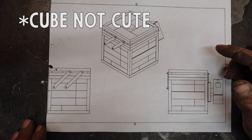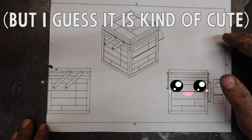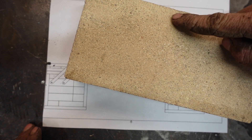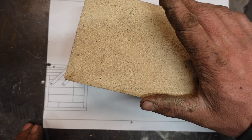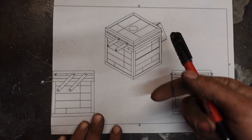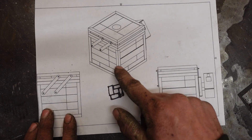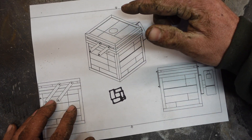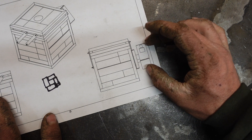We're gonna be making a cube foundry here as opposed to the many many circular ones that you may have seen, and really that is because I want to use the thick end of the brick as an insulator without using too many bricks because they're expensive. A pretty simple design, it's just a box. I'm gonna be laying the bricks like so. The whole thing will be framed in with angle iron. It'll have a cantilever lid just because I think that's cool, and then the electronics are gonna be off on a little post on the side over here.